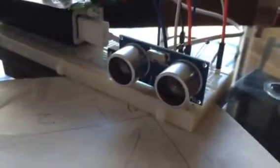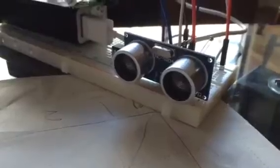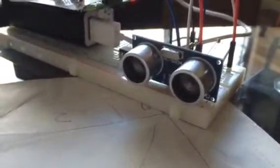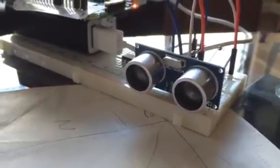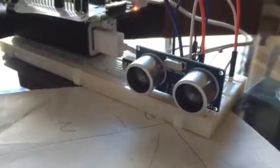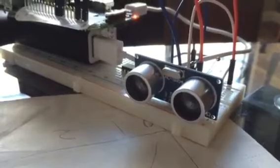Over here on the Raspberry Pi, this is the ultrasonic sensor. The way it works is it sends out a 40 kilohertz ultrasonic ping for 10 microseconds, and then there's a microphone on it that hears the echo. The distance is proportional to the time. The Python program gets two timestamps, subtracts them to calculate the time, then does some math using the speed of sound to calculate the distance.